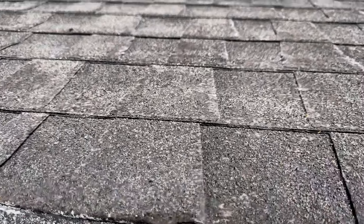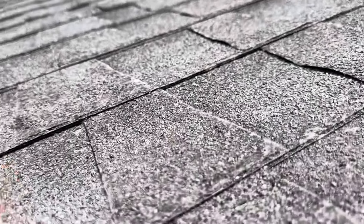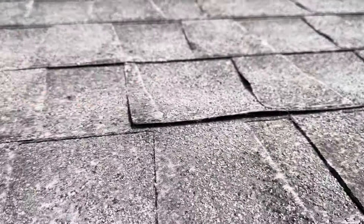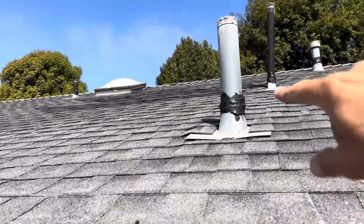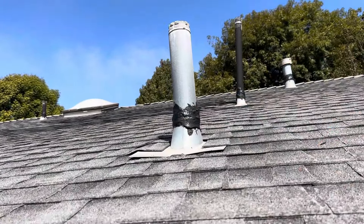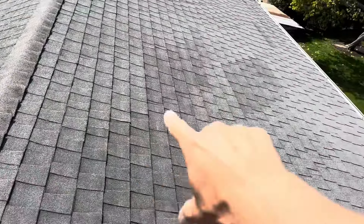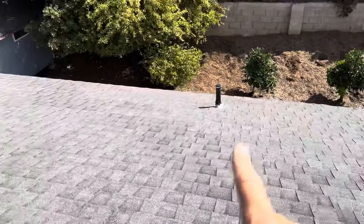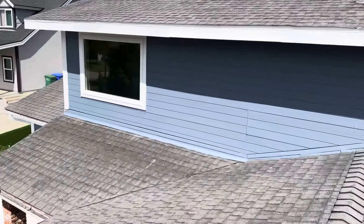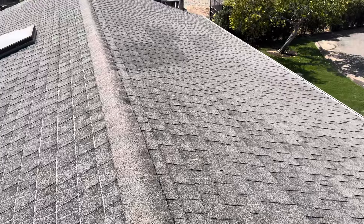You can also see just how loose this product is. I always look to see if the nails are rusted, and if you can see rust underneath the shingle, that means water is getting underneath it as well. So this product has gone past its life expectancy. You can see they came around and sealed off some of these penetrations with mastic — those are temporary fixes. Based off the condition of this roof, my suggestion is to go ahead and replace it. You can see all the discoloration; there have been some shingle repairs in the past, and you can see a whole new patch right there. These are all signs the product has gone well past its life expectancy.